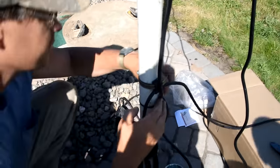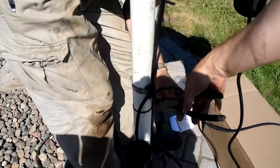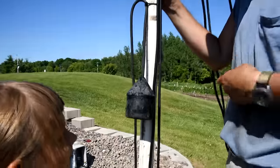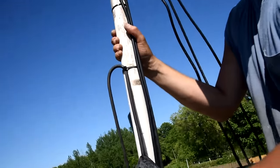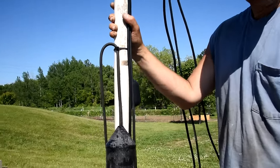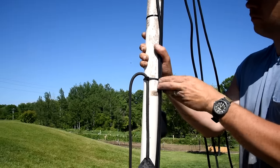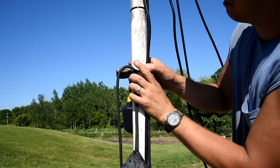Our farm is like a lot of farms — we've got multiple wells, and like a lot of older farms they had a daylight sewer, and now the house is on a mound septic. I've actually got another bathroom set up for one of the barns, so when I go into the garage to put in the alarm, you'll see two different alarms. One only pertains to this setup, and it has two floats so if one float fails, the redundancy of the other float could trip it — which I think is a good thing.